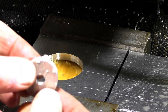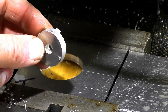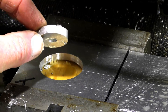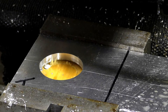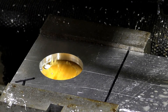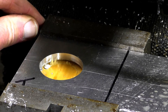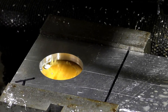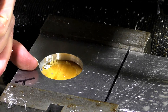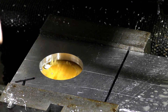Here's the slug. You can notice that in the last video I did show you how to construct the toolpaths for doing something like this. We did leave a tab on it, but the tab wasn't actually thick enough — it was just a token tab, we'll call it. It was a perfectly cut out hole, which is what we required. What I'm going to do now is run all the parts for cutting this pocket, and then we'll come back and spot the holes. Because we are using this corner of this vise here, it is very repeatable. I can guarantee that within a few thousandths of an inch, I can place the material into the same area and reproduce this pocket — or hole cut out — in exactly the same place on each of the parts. I just thought I'd show you this because it's not normally shown on any YouTube videos that I've seen.